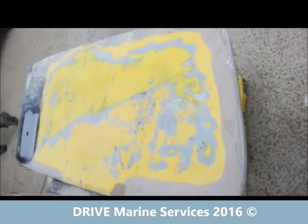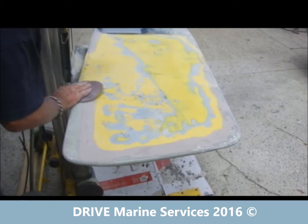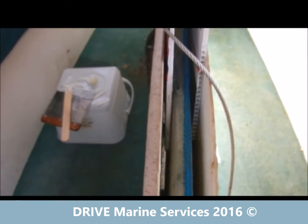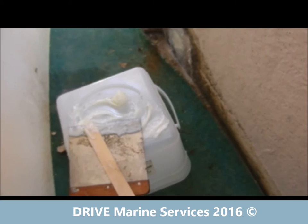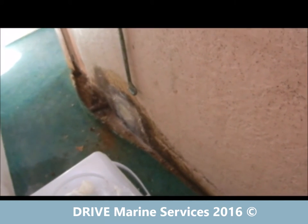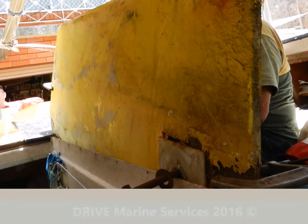The keel's not looking pretty — I was hoping to put copper antifoul on it before it went back in the boat but we've run out of time, it's the 23rd of December and I want it out of here. We've got the centerboard back in with a bit of foam each side to hold it in position and we've glued the pin in. We used epoxy glue — it's fully thixotropic, meaning it stays where you put it, with an easy one-to-one mix. The pin's in behind there, all grouped up, and it won't go anywhere now. Job finished — another job well done.